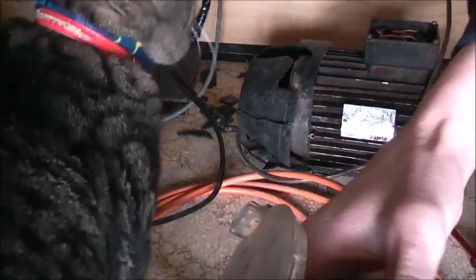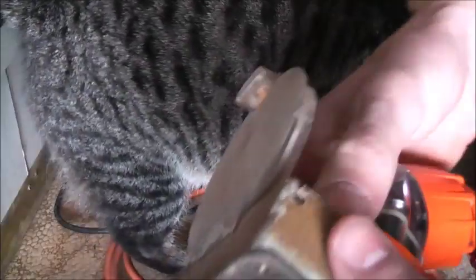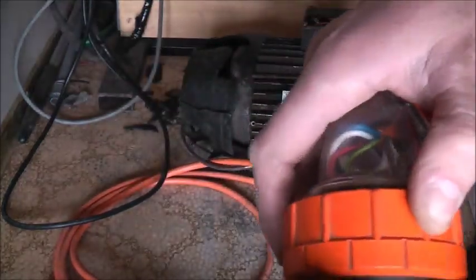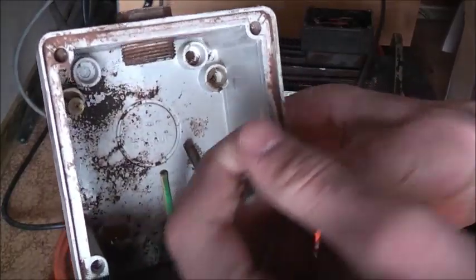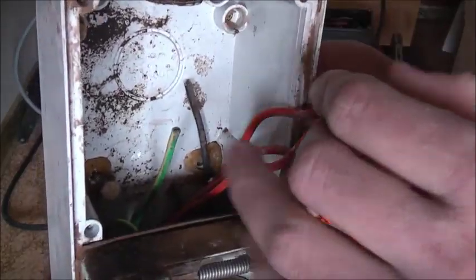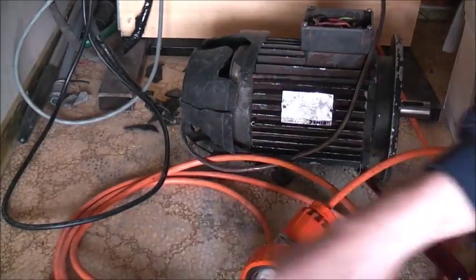It's quite nice how Clipsal design their sockets like that. They're very fiddly, but worth holding on to if you want to make one good power point out of the 2, so to speak. Yeah, there's quite a bit of clamping force in these pins, as you just found out there. It's a 5-pin version, same thing. And you have your live with 3 actives, and that goes off one side of the switch. And your power comes in, your 3 actives, to the other side of the switch, and your earth. Quite simple.